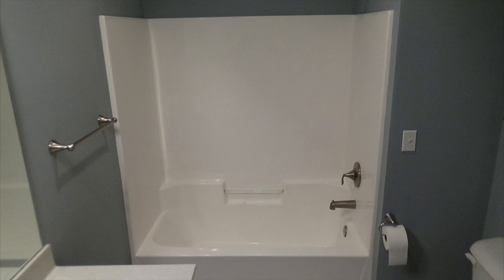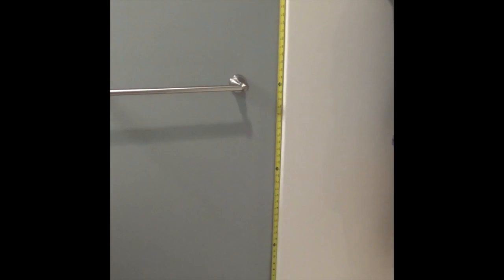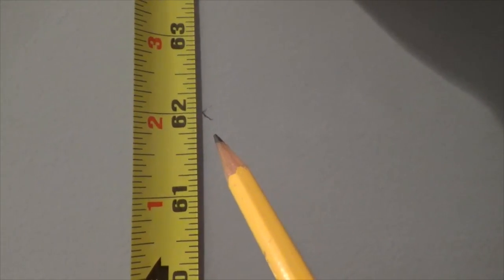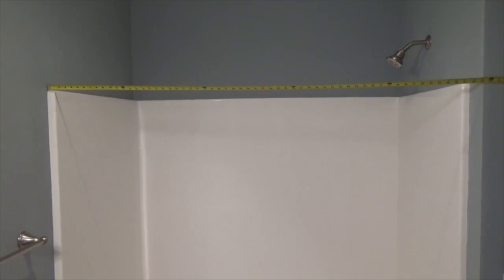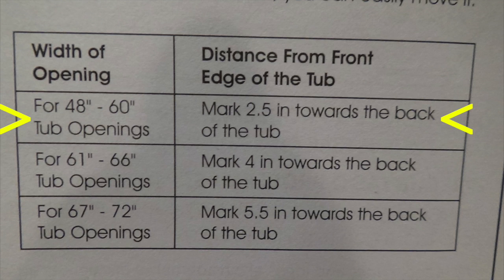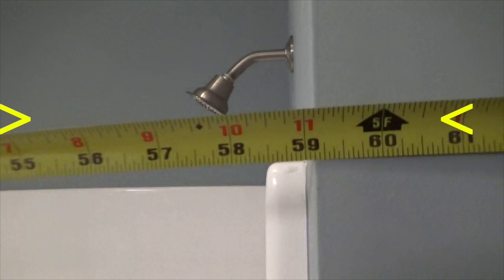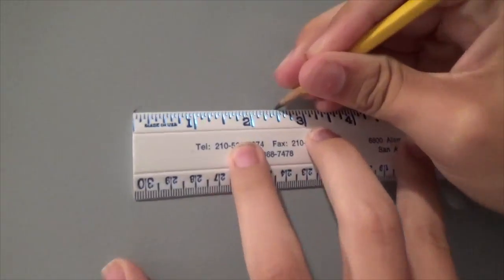I can now measure and mark where to install the rods. From the front left side of the opening, measure 62 inches above the top of the tub edge and place a small mark on the edge of the wall. Facing the tub, I will measure the width of my tub opening. For tub openings that are 48 to 60 inches, I will mark 2 and a half inches towards the back of the tub from the mark I made at 62 inches. This is the position where I will place the rod.